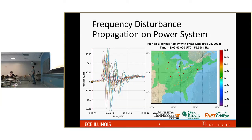The other thing I would say is that traditional synchronous machines cannot respond this fast. But I'm wondering what happens to, say, solar or wind that have solid state interfaces with the grid. If they see such a variation, do they try to respond in some way? I haven't looked into that area yet. I remember Professor Overby and T. Su have some work on virtual inertia. If they put that work into reality and operate the solar farm like a virtual synchronous generator, then this work is still going to be valid.